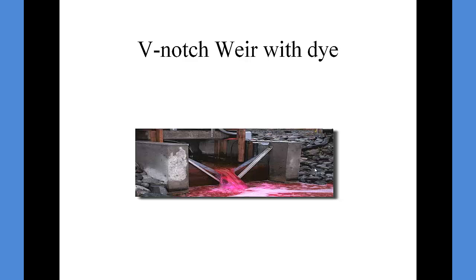I worked with someone in the city of Scarborough who had worked for years in the municipality, and whenever there was a spill, he could look at the color and knew who fed into the storm sewer — he would automatically say, 'that's company X,' and we'd go over there, find stains around the storm culvert, and be able to lay charges. Municipalities do dye tests as well, and it's up to the municipality to notify the ministry when doing a dye test. The group they notify at the ministry is the Spills Action Center, known as SAC.